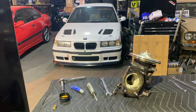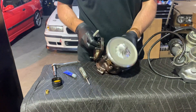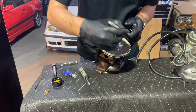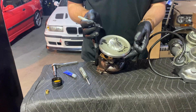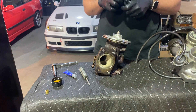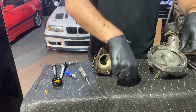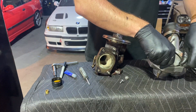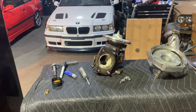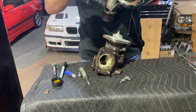Last and final step — let's reassemble the last little bits of the turbo. I'm going to write my name in here so that if somebody sees this turbo in a couple of years, hopefully it'll still be there. Also 2020. One lesson I personally learned from this: use something better than a Sharpie to make your alignment marks, because with enough greasy fingerprints, Sharpies are not very visible after a while.